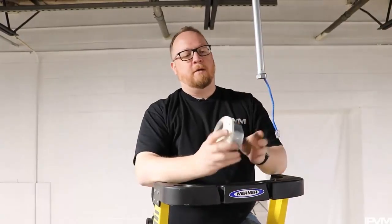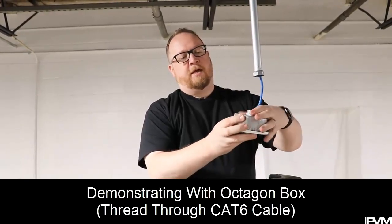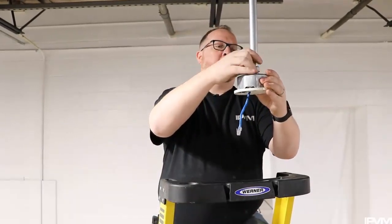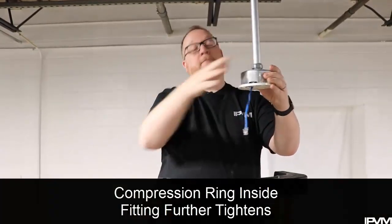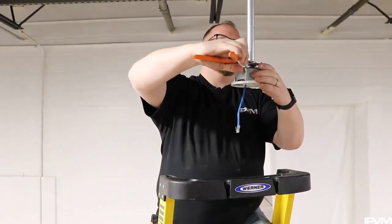At the bottom of the EMT I'm going to use an octagon box, and I'll thread the Cat6 cable through the octagon box, which I already mounted the back plate to. I'm going to go ahead and connect that. I have a compression ring inside this fitting here, so that'll tighten down, and after hand tightening it I'll use these to make sure it really stays on there.